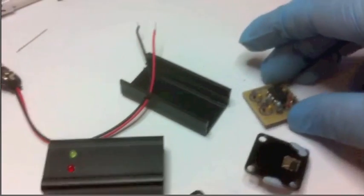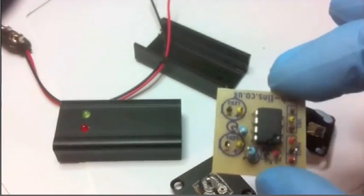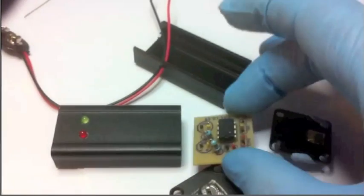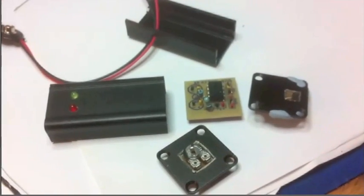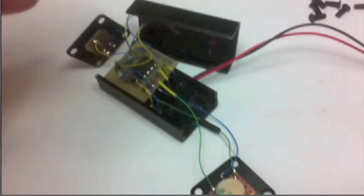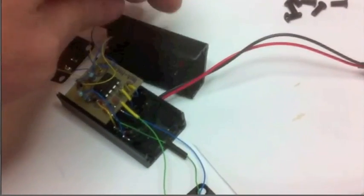With the circuit board I have used coloured leads, because I find that easier, but you could use headers if you want — just normal headers. I have used coloured leads. I have used 30 AWG wire, a very thin wire, which makes it very easy to solder all these pieces together.